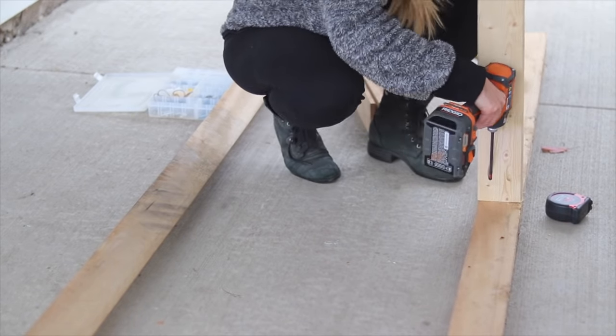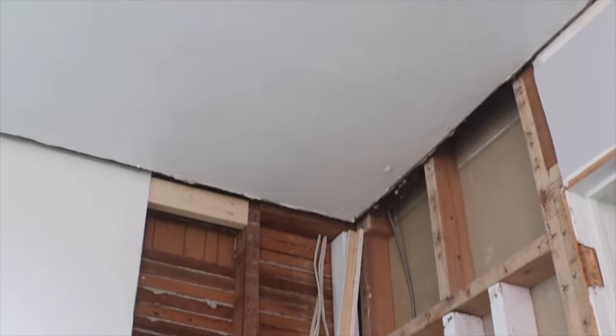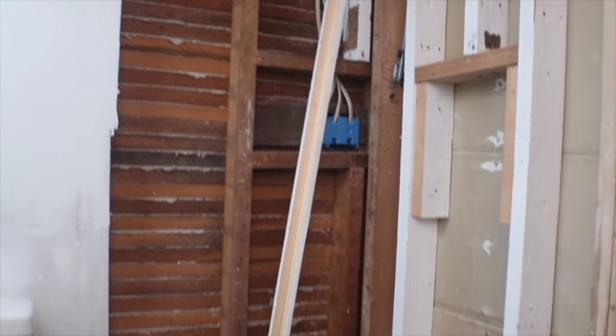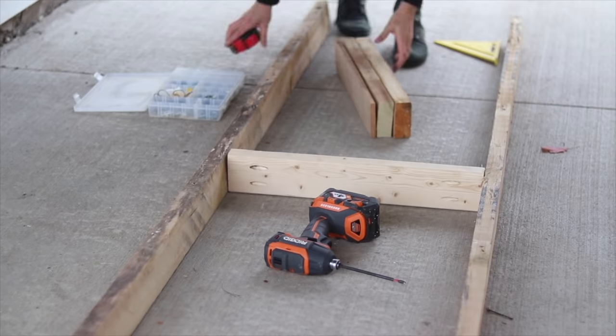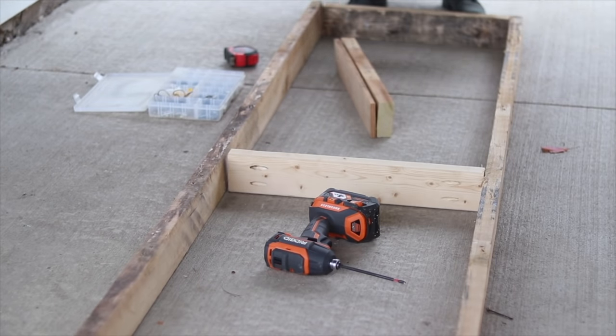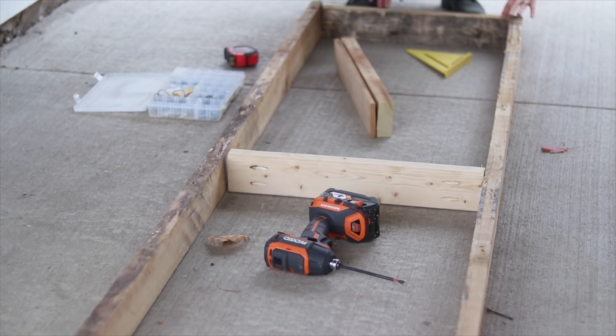The middle support piece is exactly four feet up the wall — I just did typical measurements for framing. I'm not going to be buying drywall for this either; I reused all the drywall that I took down from when the shower was in this corner of the bathroom. In my previous video I show how to remove drywall so you can reuse it. As I was framing this up I kept checking my square and made sure everything lined up nicely.